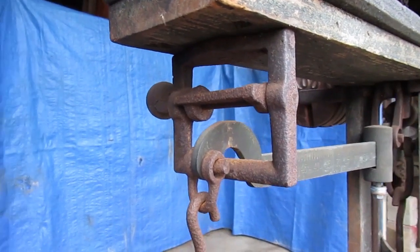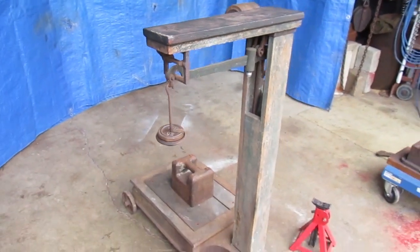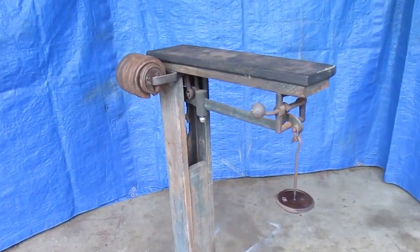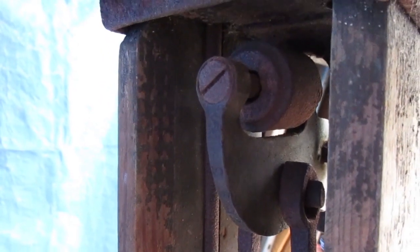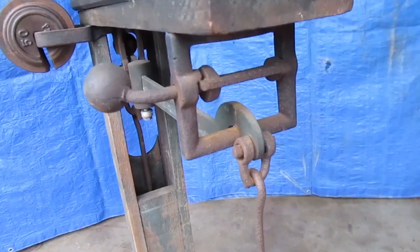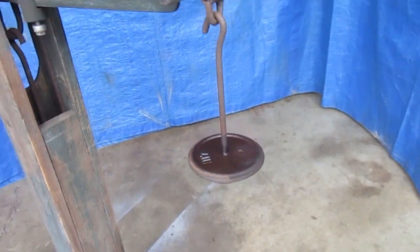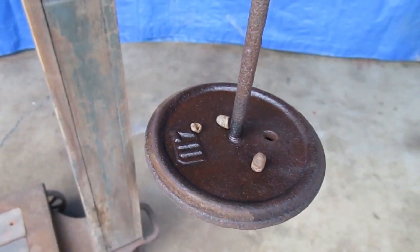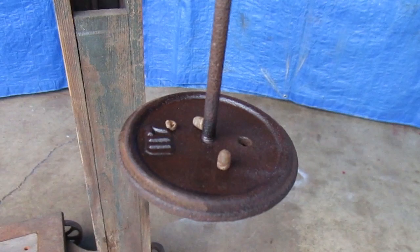Since I haven't fixed the movable weight yet I might have to tweak it again. After changing the arm length, the platform doesn't have as much leverage as it did before. I have the zeroing weight at the middle of its travel and the beam is hanging low now, so I'm gonna take all the bullets out of the bottom of the weight hanger. Now it balances with two and a half bullets. I'll put those two and a half bullets back in the bottom of the weight hanger and it'll be balancing within adjustment range again.